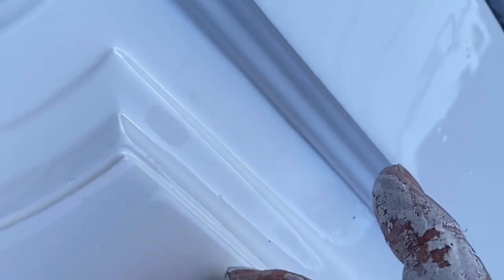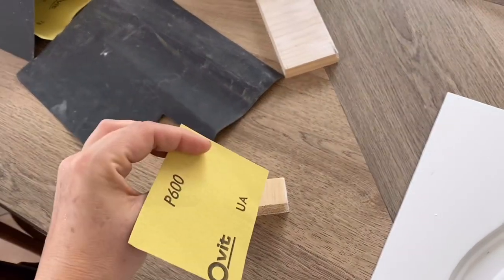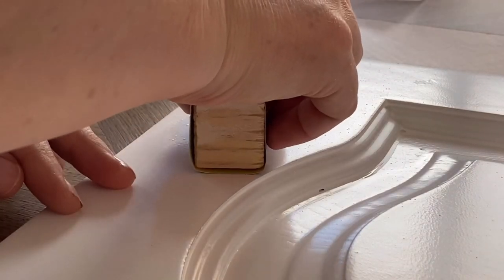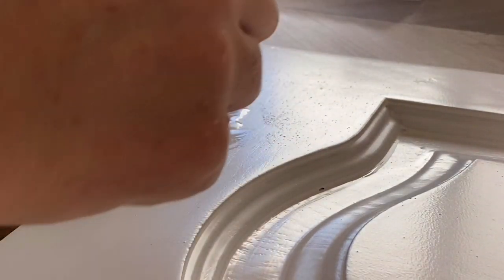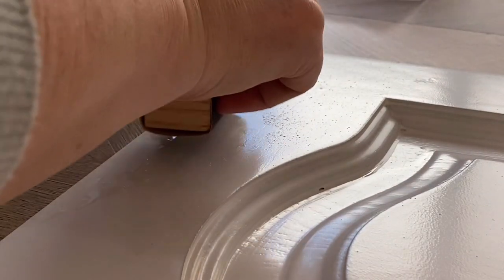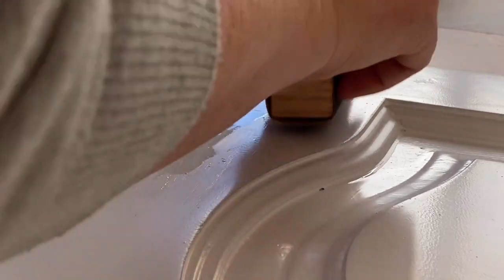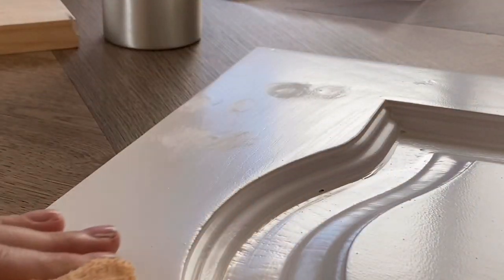Do not leave these outside to dry because bugs are super attracted to this paint. Within ten minutes there were bugs all over my painted finish and I had to sand back and start again. If you get a bug or two, use a toothpick to pick them out. If it leaves a tiny mark or you get a dust spot, use 600-grit wet sandpaper — spray down the area and just sand the top of the spot very lightly. If you go too deep you'll see it, but if it's not your final coat it doesn't matter — a gentle buff will clear any dust spots.